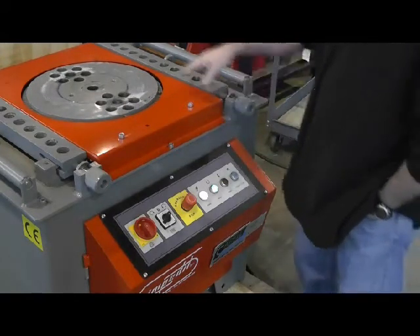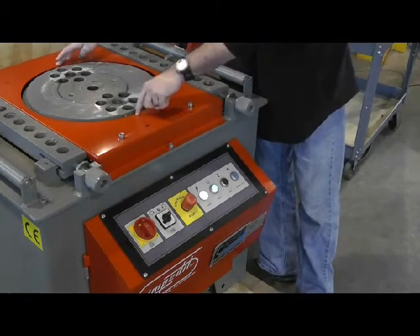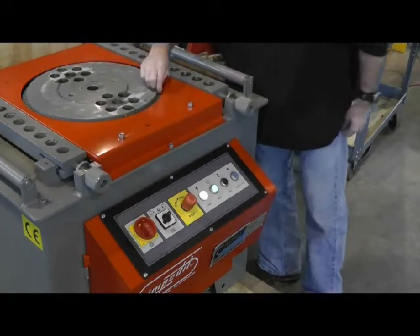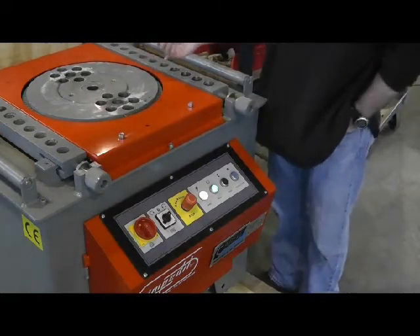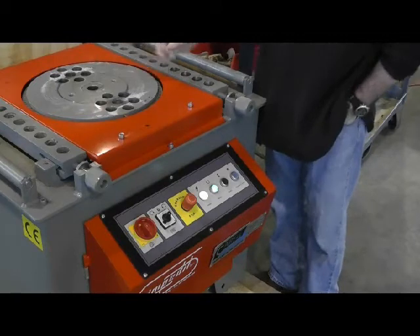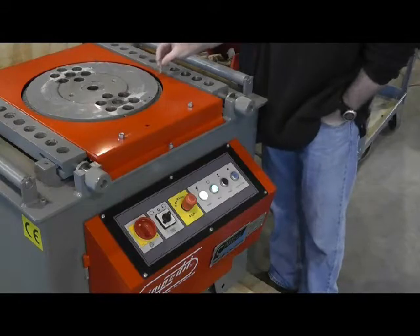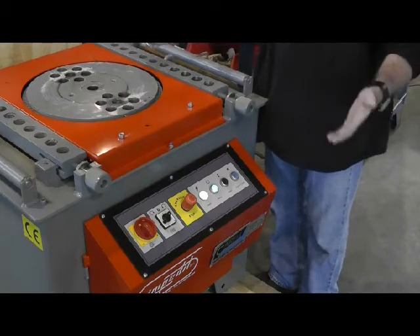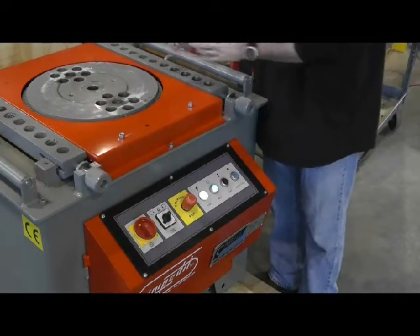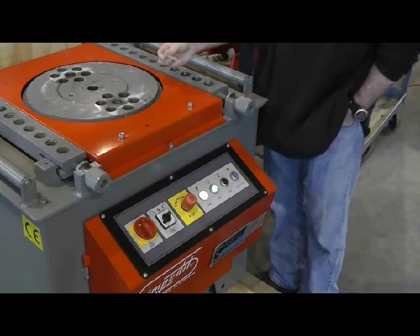Once we make these bends, it's going to stop at a certain position. We have limit switches — this is always going to be your start position, and we have another limit switch controlled by these pins, or your limit switch pins, which you can place anywhere around the drive wheel. So if you wanted to make a 45-degree bend or a 180-degree bend, you can set these limit switches based upon the angle. If you want to over-rotate based on spring back, you just place these to give it a little more or a little less, with 360 degrees in which you can place these pins.